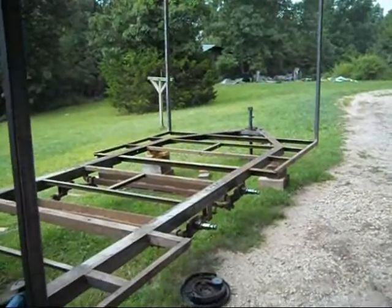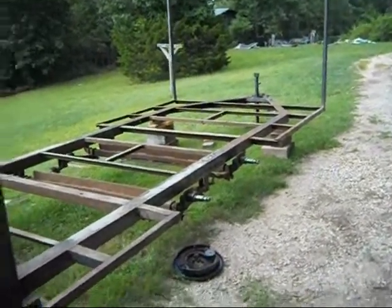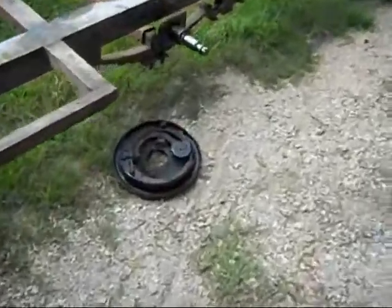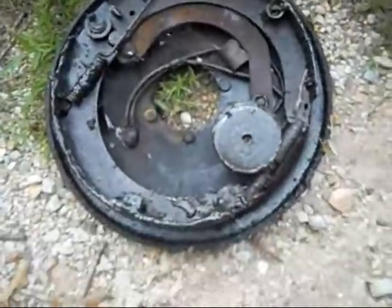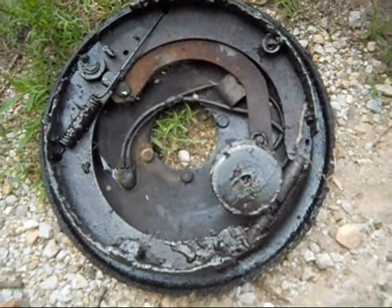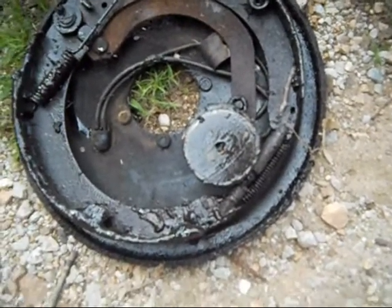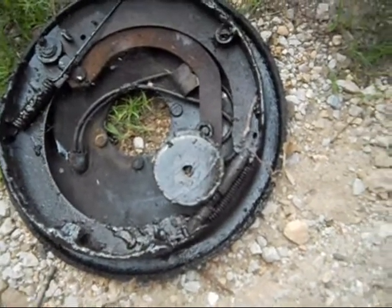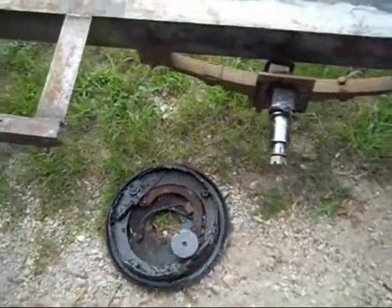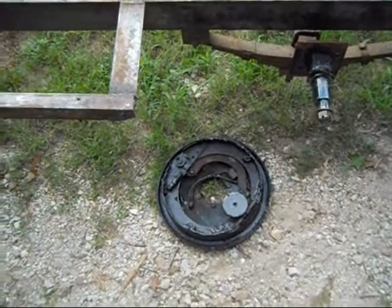This is the first update on the trailer that we've actually started to rebuild. We're over the hump on the demolish and now we're rebuilding. As you can see, I've got the frame stripped down bare. I've pulled off all the wheels and the brake backings. It had drum brakes on them and that's what three of the four of them looked like — just full of grease. Those things weren't doing a darn thing; none of the brakes were even hooked up. That little magnetic actuator is what the electrics would push against the plate to cause the drum brakes to open up. But with all that grease on them, they weren't doing nothing. So I'm replacing them. I've bought some electric over hydraulic disc brakes. They arrived the other day, so I'll be getting them on this week.